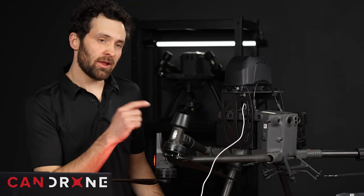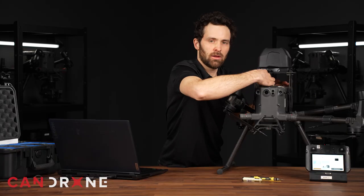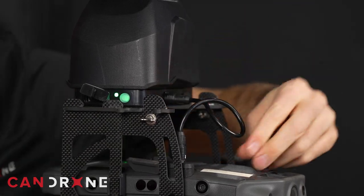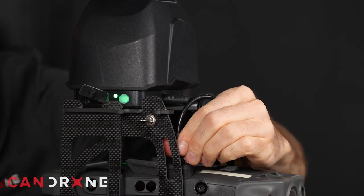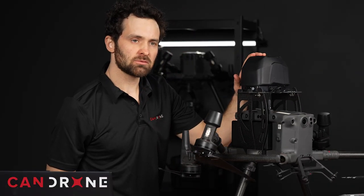Since my changes have been saved, I'm going to power down the drone one last time so I can connect the HR-30 cable, which will bring life to this AVSS parachute. Make sure the HR-30 cable is twisted tight on both the AVSS system and at the OSDK port. At this point, when you turn on your M300, your AVSS should fire up as well.